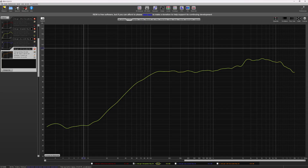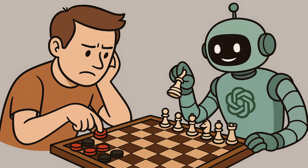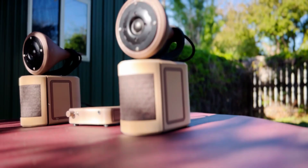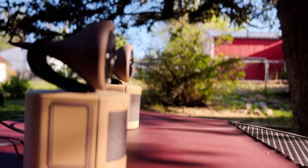Now we're gonna check out the REW sweep. See this plateau? It starts exactly at 134Hz and stays dead flat to 1000Hz. And 134Hz is the exact number that was called as a resonant frequency. Whether it's purely coincidental or all part of the chatbot's plan, I'm not entirely sure. Either way, I'm not mad. After that 1000Hz it rises steadily, which is great for desktop clarity, and there's not a single major dip either. All in all, for under $150 and coached by the AI chatbot, it's a wonderful studio setup that anyone could put together and enjoy crystal clear sound out of.